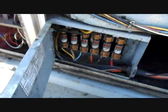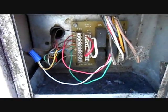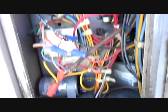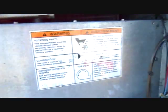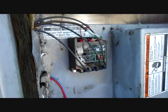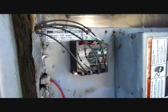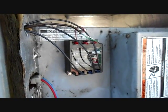The wiring runs down through here where the fuse block is for the compressor and the heater, then comes up through here and runs down to the low voltage area. It intercepts the Y signal there, gets the common signal, and then everything else goes to the top of the contactor. My help is almost here — the compressor is a beast, so I don't want to lug it up by myself. I might be able to do it, but it might be the last thing I do, so I'm going to get my brother to help.